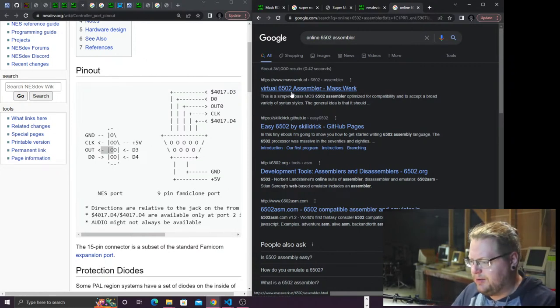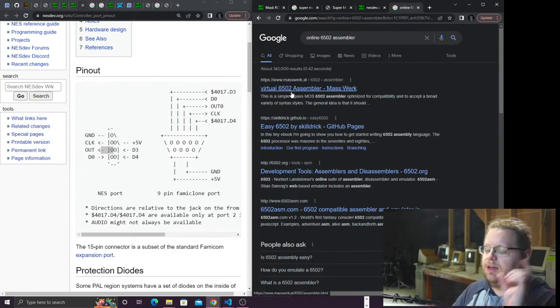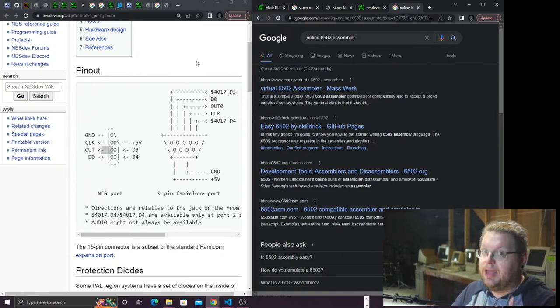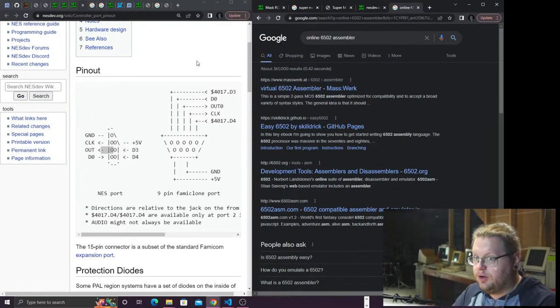And again, I'm not quite sure. I could work out what the mappings are going to be between this IC and going through the mapper chip and everything, but all I care about is that there is a couple K fixed at the highest part of memory, which is where the boot vector for the 6502 is, because I don't have the top couple of address lines that are on the mask ROM. The EEPROM will be mirrored several times throughout the equivalent space of the mask ROM, but a mirror of that highest area will still show up at the right place at the end of the mask ROM memory space. So if I just put the boot vector at the end of my EEPROM and remember what the relative memory space I'm working in is, it should just work, hopefully.